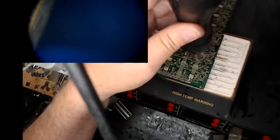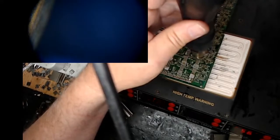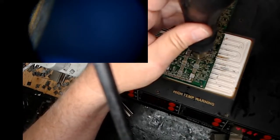Now I'm looking at the reflection actually off the light. The pins shine up at me and I can really see what they're doing for the most part. Let me see. I'll back this up just a touch. Maybe you can see it. Yeah. So that'll help me see the reflections. Here we go. Hopefully, if the chip moves, I just kind of start over. I clean off the pad, use a different chip.